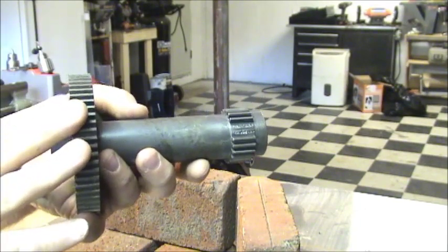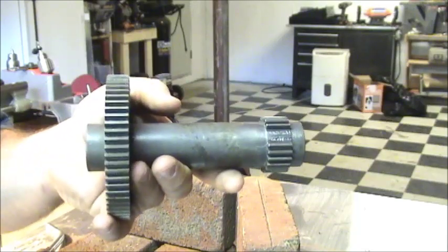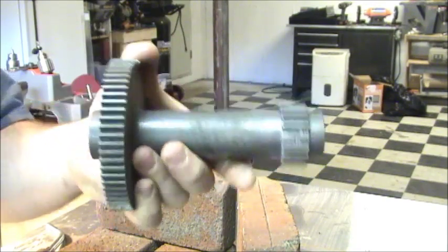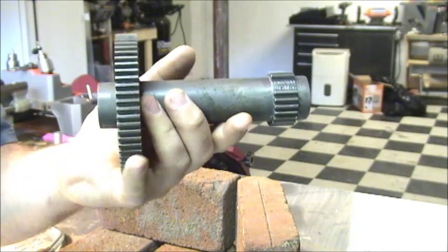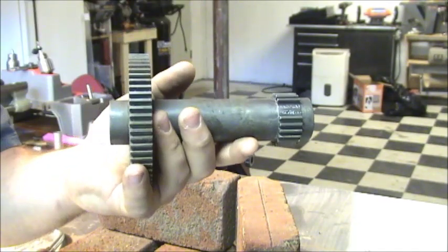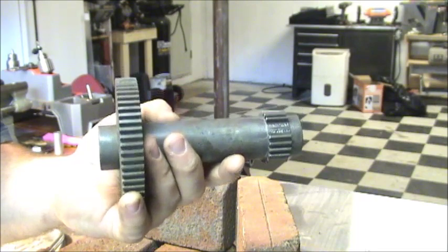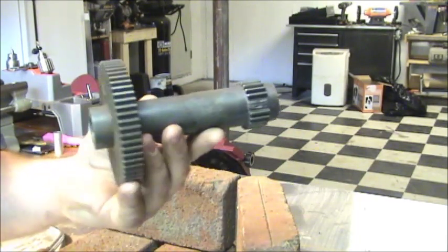The other thing you don't want to do, unlike you can do with steel and some other metals, is quench it. You don't want to finish this up and drop it in a bucket of cold water. All you hear is a big crack, and you're screwed. Actually, when I used to do furnace changeouts, especially the steam boilers, they're taller than I am. We could never get them out of the building. What we used to do was knock them down, heat them up with an oxyacetylene torch, throw cold water on them, and crack them with a hammer into pieces.